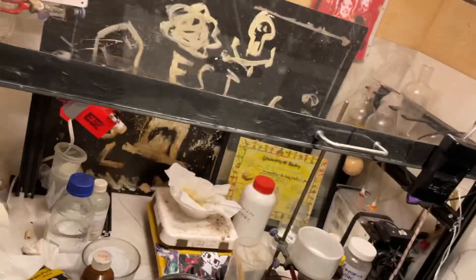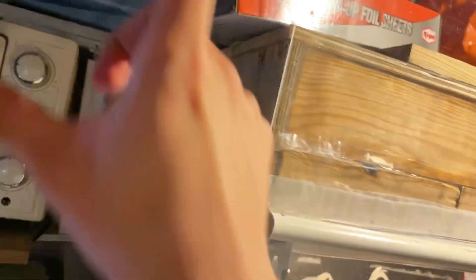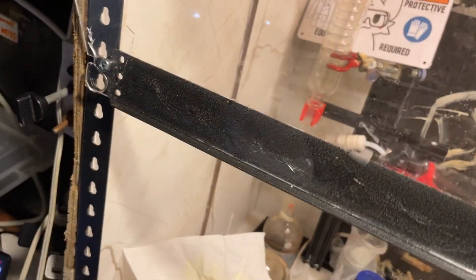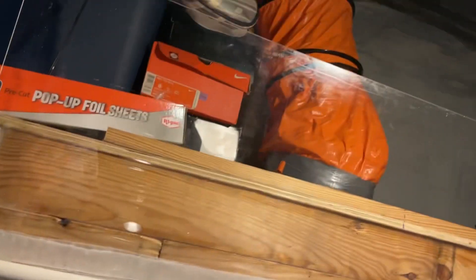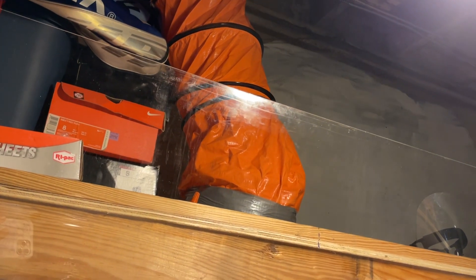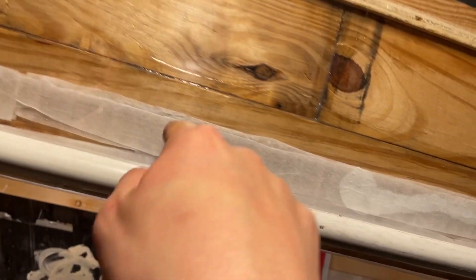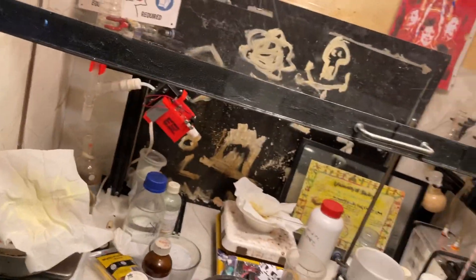I could build an even larger one, but this one's already kind of too big. The house is rented, so the homeowners installed some janky shelving, and the L bracket is actually hitting the top — it's a bit dented up there. For a future sash, I'm probably going to do gravity with a counterbalance weight, or spring-loaded, or motorized — though motorized is a bit tricky. The pulley one's also tricky. I also need a better way to mount the sash because the plastic PVC pipe is bowing under the pressure. Either way, the fume hood blower's strong enough, so I don't really care.